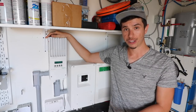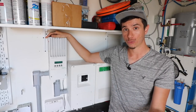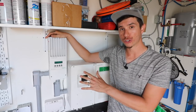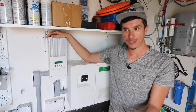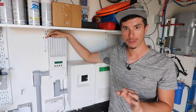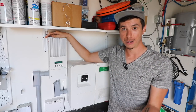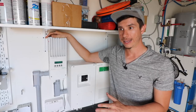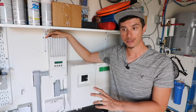The major thing to watch out for if you want to use lithium-ion batteries is whether your charge controller supports charging lithium-ion batteries. This is extremely important — if you use a charge controller that doesn't support lithium-ion or a custom charging cycle, you could blow the batteries up and they'll catch on fire. Contact the manufacturer of your charge controller to confirm it supports lithium-ion. Since lithium-ion batteries are becoming much more popular, more charge controllers are supporting this.